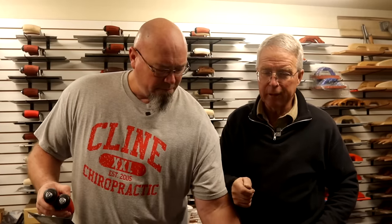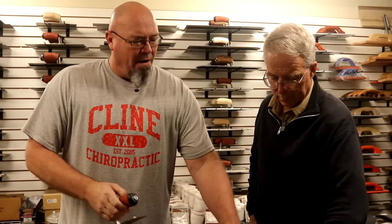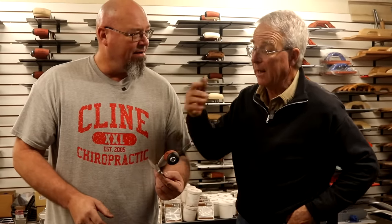Per square inch, clean to the end. When I'm applying whatever that measurement of weight is — say 30 pounds — I'm applying 30 pounds over a 5x20, call it 100 square inches. Now I'm applying 30 pounds to a 4x16, that's 64 square inches. And then a 3x8, that's 24 square inches. So you're getting more PSI but the same burden on your wrist. In your case, it's more than 30 pounds. It's like the eight-pound sledge — at a certain point you needed a six-pound, and now you're to the point you need a four.